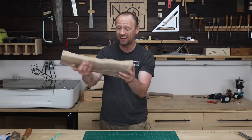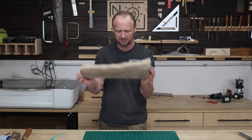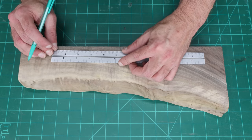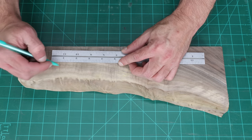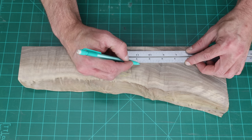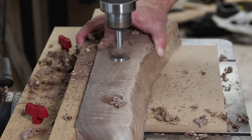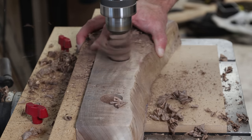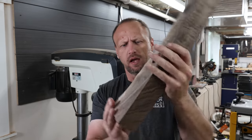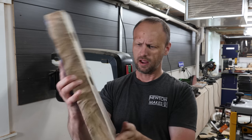Look at that — that's insane. I've done this before where I've taken off bark and it looks kind of ugly underneath. Sometimes you luck out and it looks like this. Next step is I'm going to mark where I want to drill a couple of holes. I'll move a couple inches down from the top, mark where I want to drill a hole, then move a few more inches down and mark again. I'll probably make these a little bit off-center because that live edge is a little bit wavy and you can't really tell exactly where the center point is. Then I'll head over to the drill press and drill out both holes. Now I'm going to go over to the table saw and cut an angle along the bottom — I'll cut an angle, see if I like it, and if not, maybe I'll adjust it until I get the board how I want it.